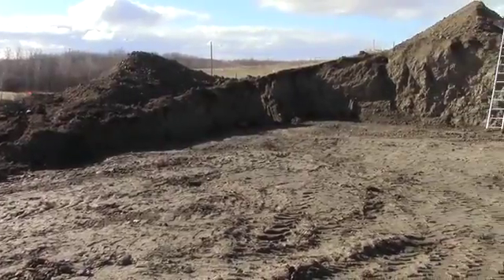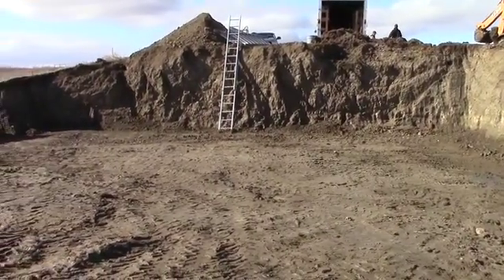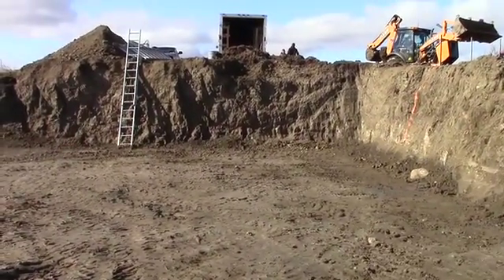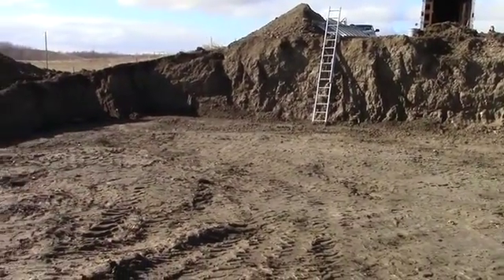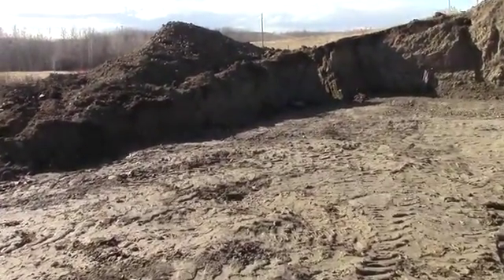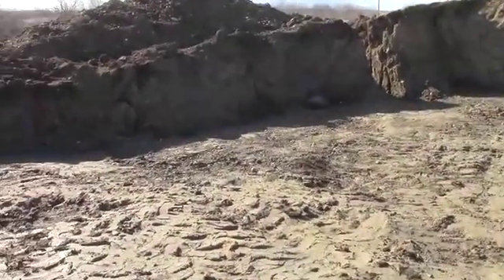The basin part of the excavation is mostly level, but we actually have to tweak it a bit — it's got a few humps and lumps and we're out about two inches, so we need to fine-tune that. We also need to clip the top corner of that excavation off clean before we're ready to do our steps. I've got some blue paint on the side bank here — hopefully you can see it.